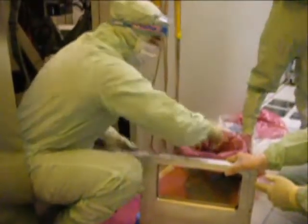When using the Scrub-Rite pen, use the same process as before: scrub with the pen, wipe the surface with the Ultrasolv sponge, unload the deposition from the pen onto the sponge, and rinse the pen off in the DI water.